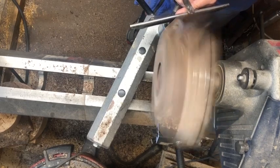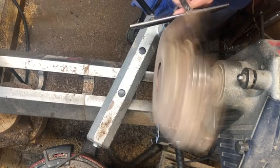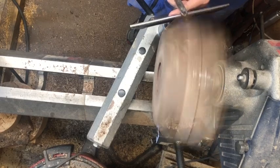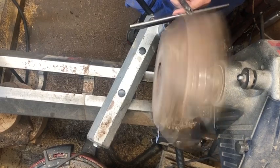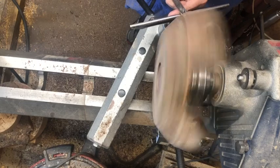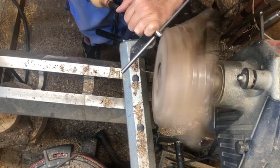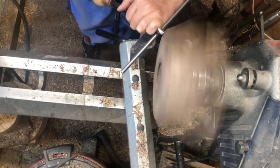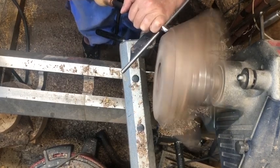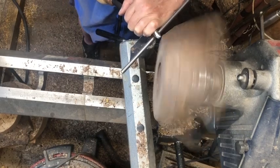What I'm doing there may look a little backwards to you — it looks like I'm going against the grain, because I'm going from the far outer edge toward the bottom and toward the inner on the outside of the bowl. It is against the grain, but because this is live edged, I don't want to pull the bark off, especially at the very top edge. I have to go against the grain, but then I turn right back around and cut up almost to the top — going downhill with the grain — and it gives me a nice smooth surface there.